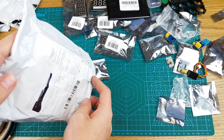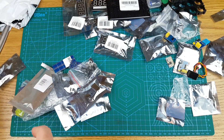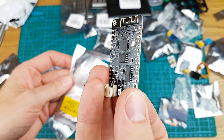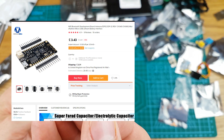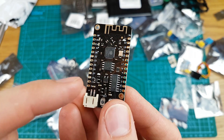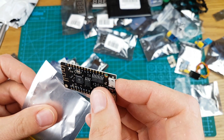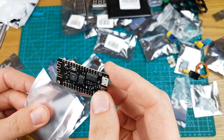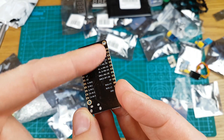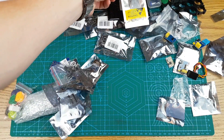This is listed as expansion board mod jaw, which is a generic term for all sorts. Let's go with this one first — this is a Lolin 32 board. Or it is a fake one — a dodgy one. This has a problem with the charging circuit: apparently if you plug it in the LED doesn't show the right characteristics, and it's to do with the TP4054 charging IC. So I bought some of those and found out this is actually dodgy or broken or fake, so I need to fix that. But it's an ESP32 with USB to serial, battery management, and various IOs. It's a bit outdated now that we've got tiny Picos and all sorts of cool things, but still a cool little dev board to play with.